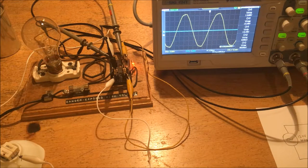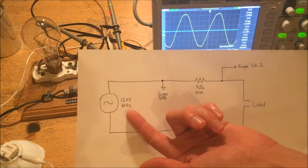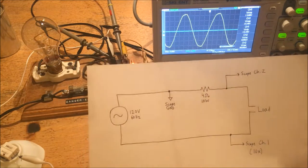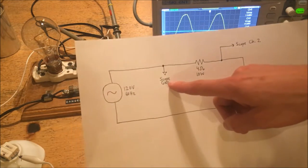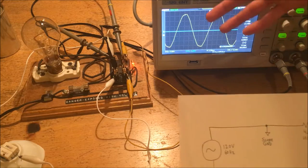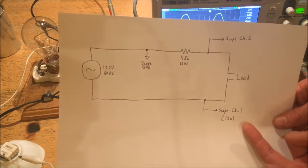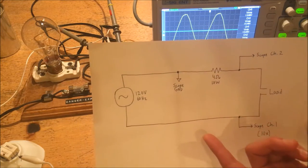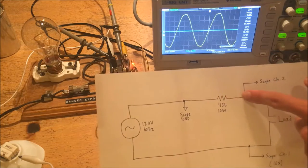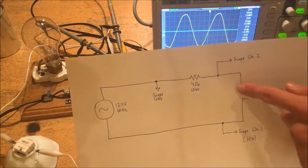I've set up my workbench a little bit differently. I have my oscilloscope set up, and there's an almost sinusoidal waveform being displayed. I have it connected as follows: I have my 120 volt 60 Hz source connected behind an isolation transformer, both for my own safety and to protect my oscilloscope, since the oscilloscope ground is referenced to the ground pin. I have channel 1 connected with 10x attenuation to display the voltage across the input, and channel 2 connected on the other side of a 4 ohm 10 watt resistor made from two 8 ohm resistors in parallel, which then connects to my load.